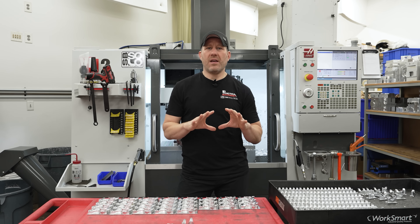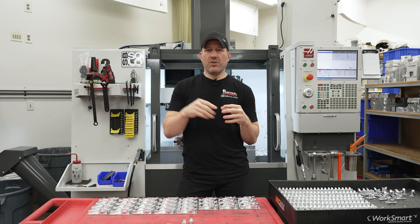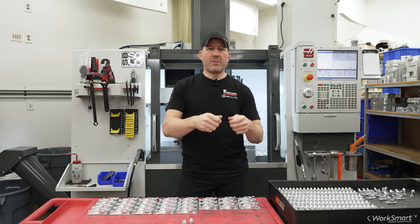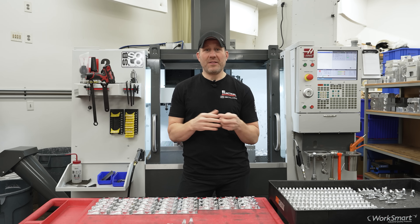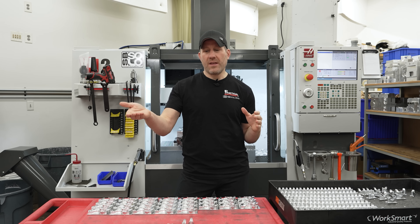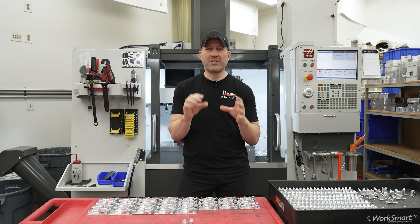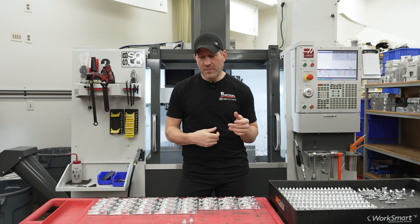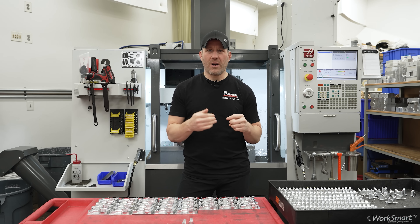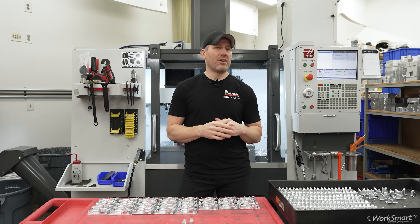One of the main reasons people do it on a three-axis machine is they have very small parts. Say you have a strip of metal and you make a bunch of different little parts on there, profile them out, so you have like five parts that are super flimsy but you have this big stock on the bottom. If you were to bandsaw those apart and flip them around and try to rough that stock off, you would probably just bend the part and ruin it — it's just way too much cutting pressure. So what you do is take a slitting saw and slit all the way down the bottom, and then you just have this little piece you can break off. You can slit saw it as close as five thousandths if you want, then flip it on op 2 and cut it. It's kind of like a lathe where you part it off — you can undercut the chamfer and meet in the middle, and you have a little sharp edge but it's probably good enough where it won't matter.